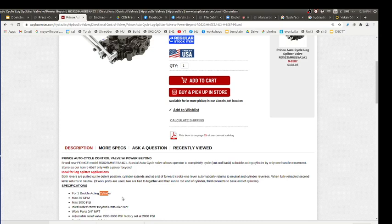That would work too, but that wouldn't be great design, because you typically want to leave your pressure reliefs for emergencies. They generate a lot of heat, so every time you stopped something, you would be generating a lot of heat. The way they work is, whenever something's restricting flow, it's turning that fluid flow into heat. So if you can accept that heat, that's fine. If not, if you're stopping and going with a cylinder valve on a motor that spins fast, it would build up a lot of heat and might overheat. In which case you want to use a motor valve, which free flows, so you can free spin.